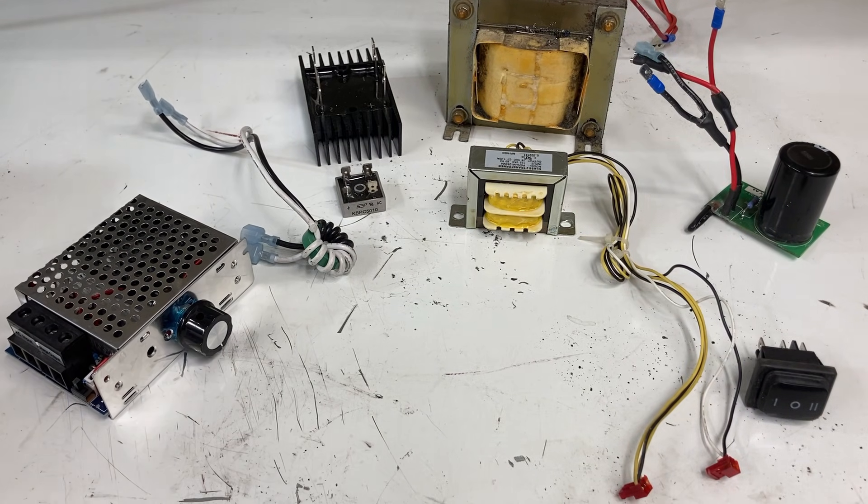With that out of the way, let's start with the basic question: why would anyone want to use a treadmill motor? You can easily get a treadmill for free or 20, 30, maybe even 50 bucks, bring it home, take it apart, and pull the motor out. Treadmill motors run on DC current and are really easy to vary the speed on, so you can use them to power anything that you want variable speed — my lathe, my mill, my bandsaw. But in order to do that you need a power supply, something that will convert AC current into DC and allow you to adjust speed.